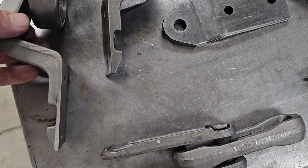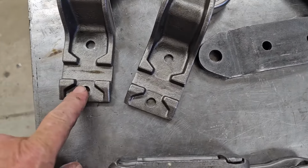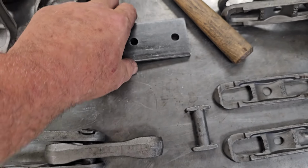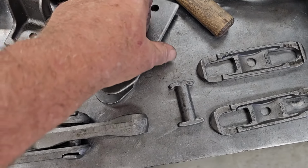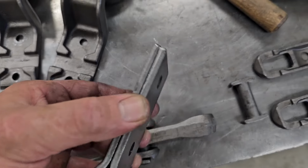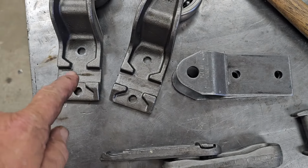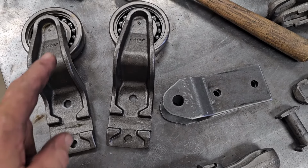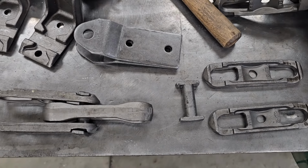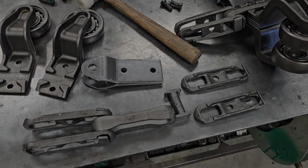And in addition to that, symmetrically, the rollers, left and right halves, very symmetrical. And you see how they slide inside of the dog bone with the parts holders. Those bolt in. After you have left and right halves of the rollers in the dog bone, and this slides inside, unless this comes out, there's no way to get those out. So you can change a roller on a conveyor anywhere on the line. I just thought I'd throw that in there. Some people were interested in how a conveyor chain goes together, but that's how a conveyor chain works.